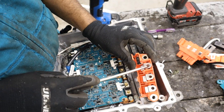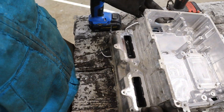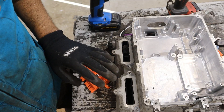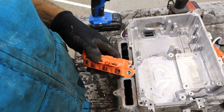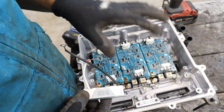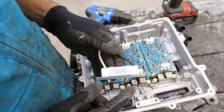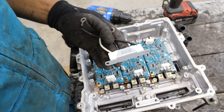I'll pry this piece out. These are the junction boxes so the inside connects here and the outside where the cables are connects here. One thing is these connectors actually sit right-side up, so if there's any water it literally just drains into the connectors and corrodes these junction blocks. At the corner here we have this white resistor — a 35.3k ohm resistor. This is responsible for discharging that big capacitor that sat right on top, so if you're not smart enough to disconnect the current, you won't be shocked with as much voltage as you might expect.